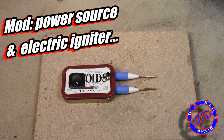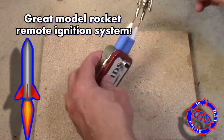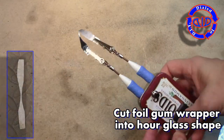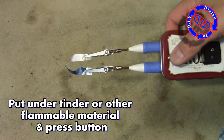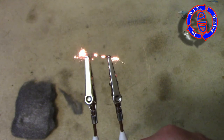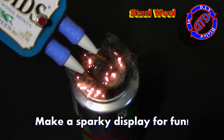Ready to add some more functionality? It's easy to do — just grab a couple of alligator clips and put them on your electrodes. These happen to have screws that help you tighten them down and remove them later when you want to. You can now use this for the very reason I designed it to begin with: as a remote ignition system for something like model rockets. You can connect some wires and you also have a perfect little switched battery pack. If you leave the momentary switch off it works even easier for that purpose. Grab some foil gum wrappers and you also have a perfect little fire starter — hold it under some tinder or flammable material before you press the button and you're good to go. The reason this works is because you've created a little hourglass-shaped design in the foil; the foil short circuits and then the paper begins to burn once the foil gets hot. You can do the same thing with a little bit of steel wool. You would be amazed at how many times you can repeat this with just one steel wool pad. And if that's not flashy enough, grab a wad of the steel wool and spark it up with your electrodes.